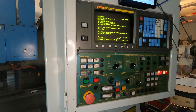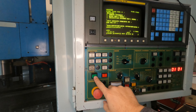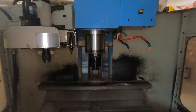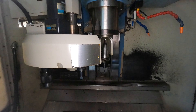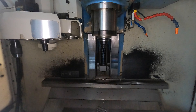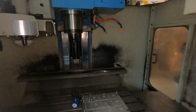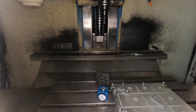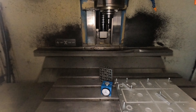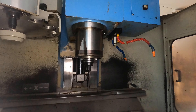I've written a small program to switch to tool number three, so I'm going to go ahead and put the machine into auto mode and we're going to switch the tool. From here, we're going to go back to the handle and move it back down, and pull the tool out so we can readjust our offset.